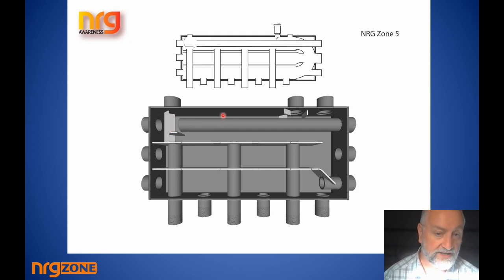All of this water is now turbulating, the air rises to the top, and that's where it's captured by unique little baffles. If there's a lot of air when the system is first started, some of it will pop over the small blocking baffle, get trapped in the top right corner, then find its way back around the side and out through the vent — so the system vents itself very quickly. At the top of each chamber — flow, bypass, and return — there is an area with very little water activity, designed to capture any air coming back from the zones or boilers. Small purpose-made gaps in the side plates allow air bubbles to rise and keep venting to the outlet, large enough for air but not enough to allow significant heat drift.